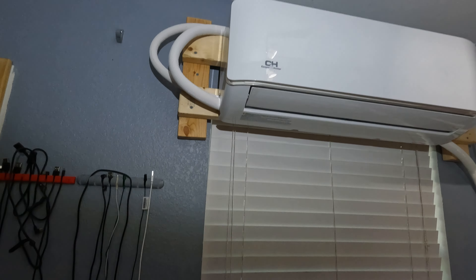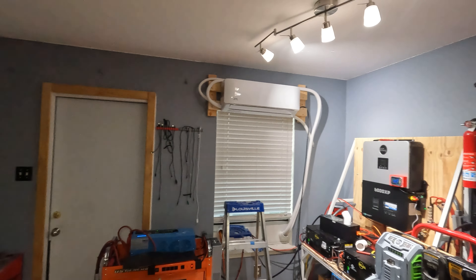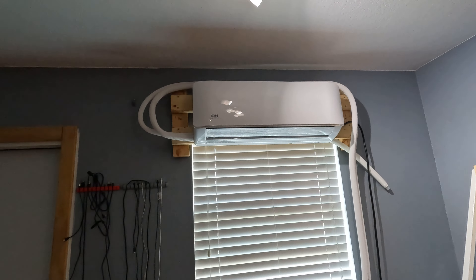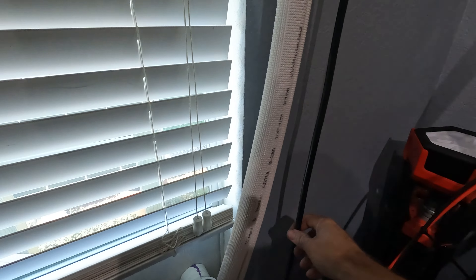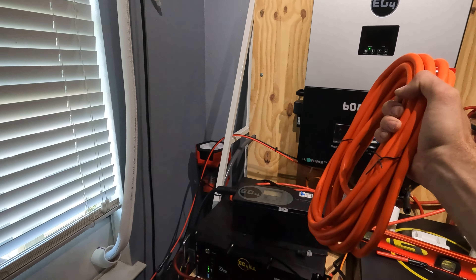The line set is pretty much run — I just looped it around and it goes along the top. I'm going to build some brackets to hold that, and then it joins the drain tube and wiring, which already runs outside. I'm going to push it against the wall and make it look a lot cleaner. I have not torqued any of the fittings yet — this is literally just test fitting. I need to run the cable outside to the outside unit, run the condensation drain, and connect power to it so we can plug it into our solar generator.